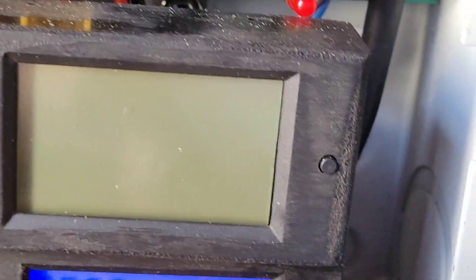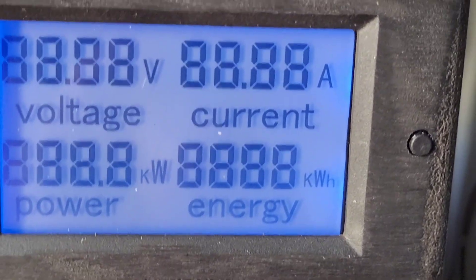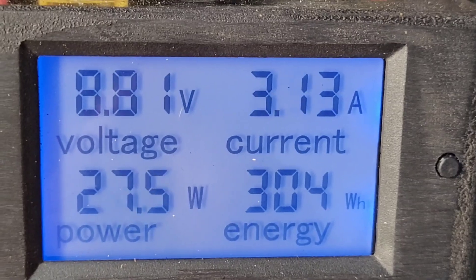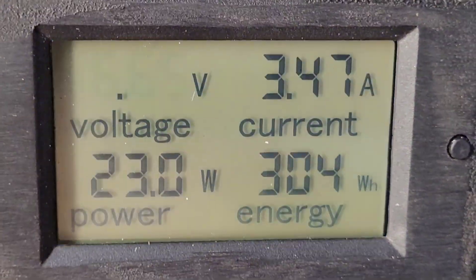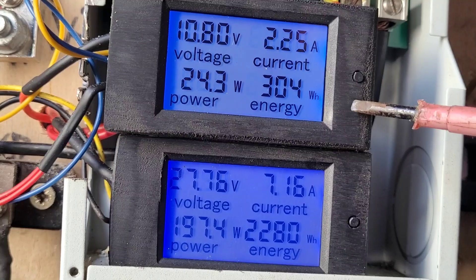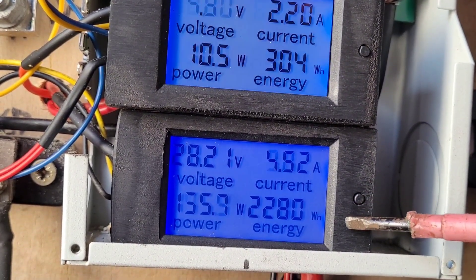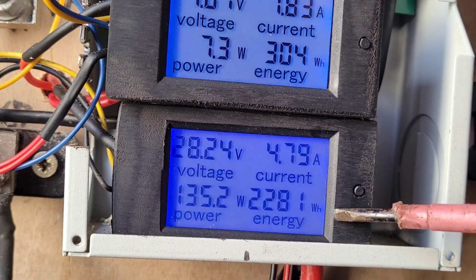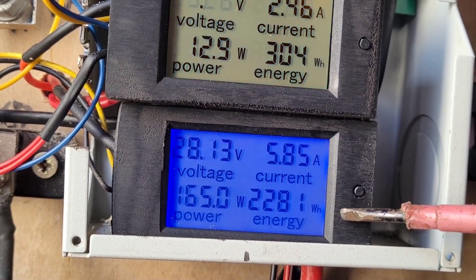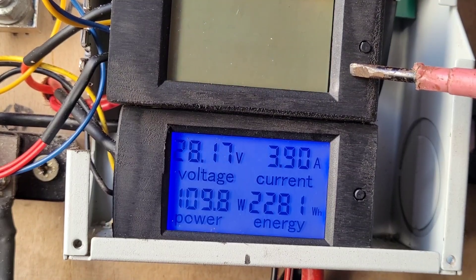When I came in about half an hour ago the dump load was on 205 watt hours, and that was reset at about 10:30, so approximately five hours. Look, so in five hours that's put 304 watt hours to the dump load. That doesn't get added on to the 2,280, so the power the turbine's made is that, but the dump load's just been running for five hours and it's put 304 watt hours in.